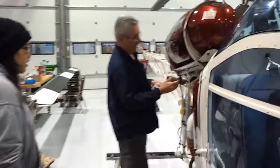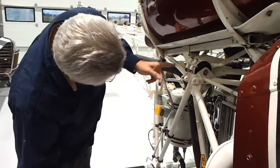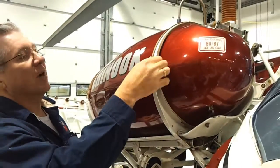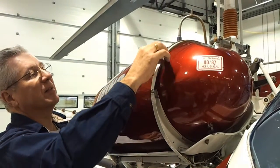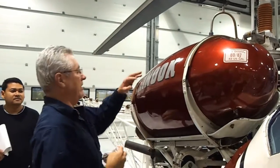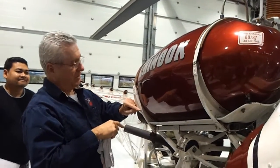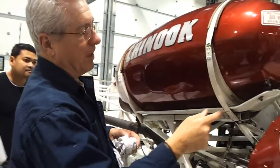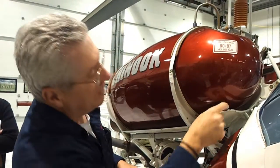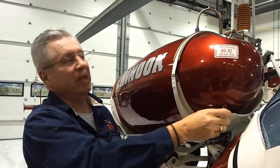Attaching points for the gas tank — we make sure there are no cracks and that the strap is tight. This just stops it from rubbing on the paint. You can see places where the paint is chipped and cracked a little bit, but we want to make sure the metal is not cracked. This is a grounding strap, just for static electricity.